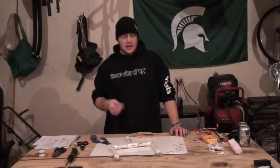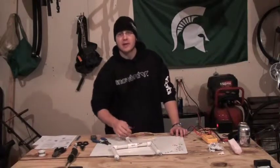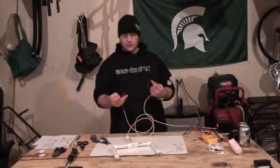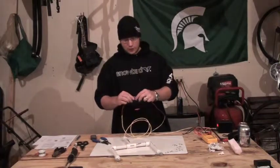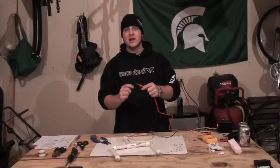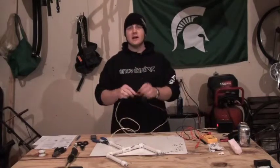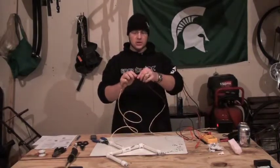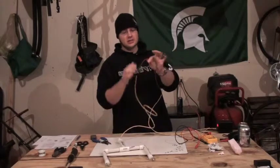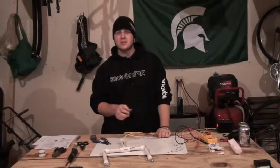These circuits are so basic — if your power supply isn't working or your wire isn't heating up, it's usually pretty straightforward. First and foremost, make sure all of your connectors are attached. If you're using alligator clips, make sure they aren't touching each other when going between your power supply and your actual cutter. If your two wire connectors touch each other, you're gonna arc through there rather than going to your actual handheld cutter.